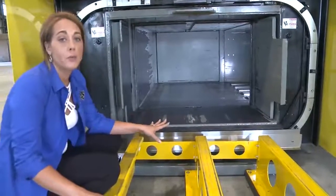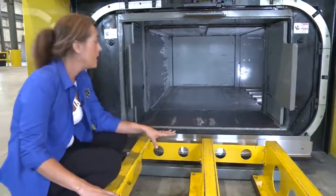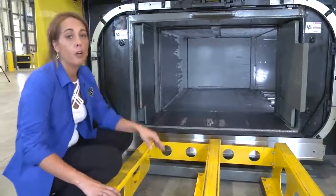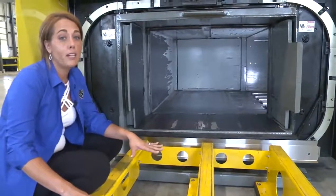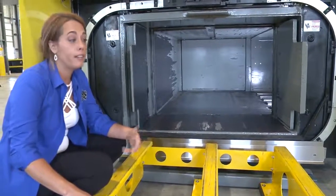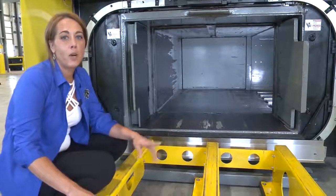Another phenomenal feature of the BaleWolf 2 Ram is removable bolt-in liners. Instead of having all your liners plug-welded, we've made it so you can bolt them in, which reduces your time in relining your baler and reduces your cost of ownership.